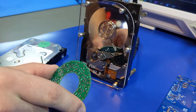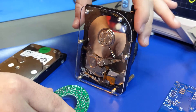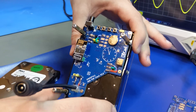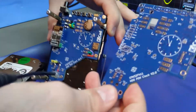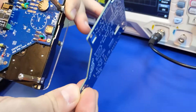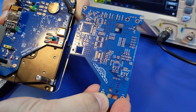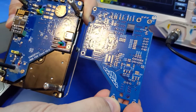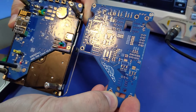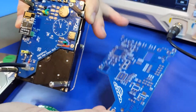So how do I turn on the LEDs? How do I read from the sensor? On the back here, you can see I have redesigned the main board as well. I've got a main board here without any of the parts on it. And I was actually able to hide most of the circuitry on the inside. And that includes an ARM Cortex processor, a real-time clock, level shifting for multiple components, a motor driver, and voltage regulation.